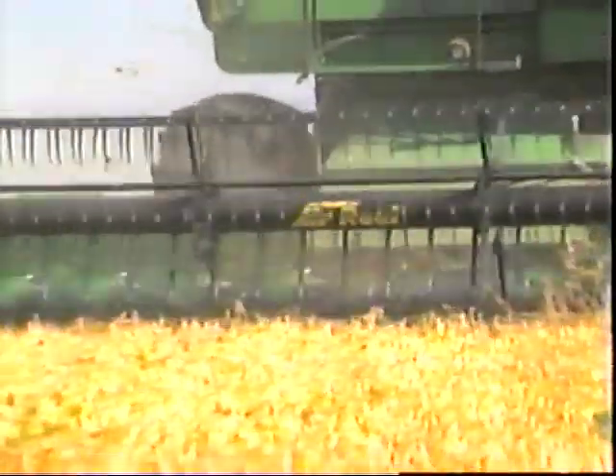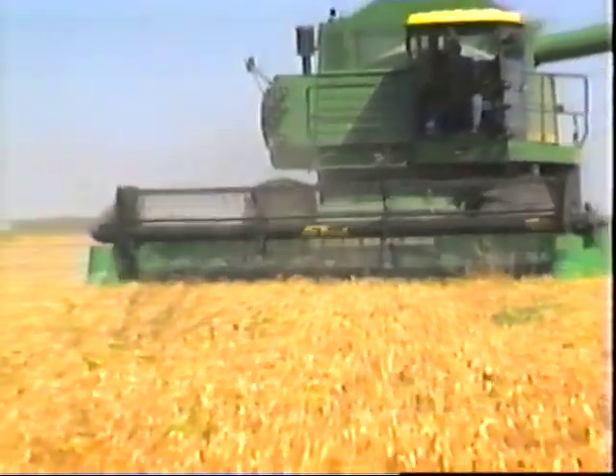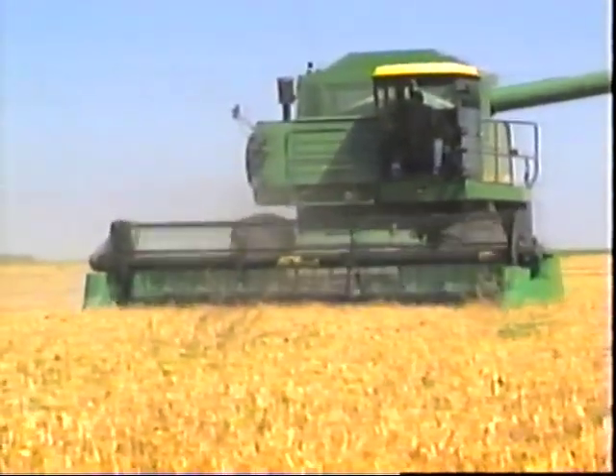The Finger Air Reel is more gentle on your crop during harvest. Because the air causes most of the crop to feed in, you don't rely on the reel and don't run your reel as aggressively to get your crop to feed in. You'll reduce the shatter loss caused when the reel strikes your crop and knocks some of it to the ground. I think the air reel has quite a bit less reel shatter because, again, we're running slower. We don't have that whipping along trying to get the even feeding. We're running the reel slower.